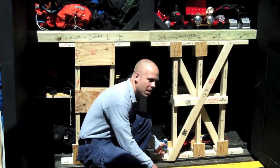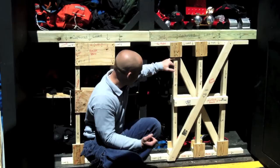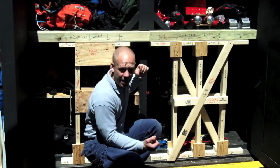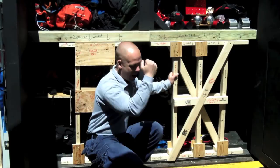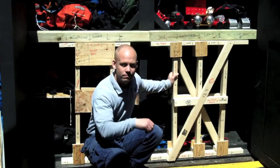Before we make these gusset connections and cross brace connections, we're going to take those wedges and drive them together. We're going to put an upward force on the verticals and a downward force and snug it right in place — same deal across the board. Keep it perfectly plumb so we take that load and gravity and bring it straight down into the ground. I hope this explains it and gives you a good picture of what you just read. We're going to stop now, do another video, and we'll cover the 45 and 60 degree rakers. We'll see you next time.